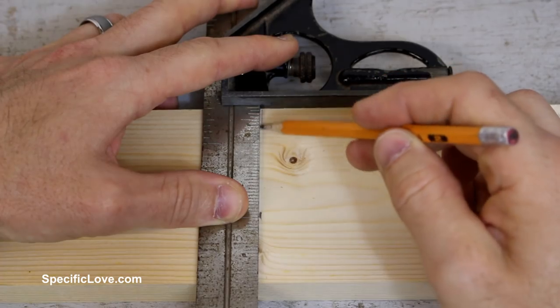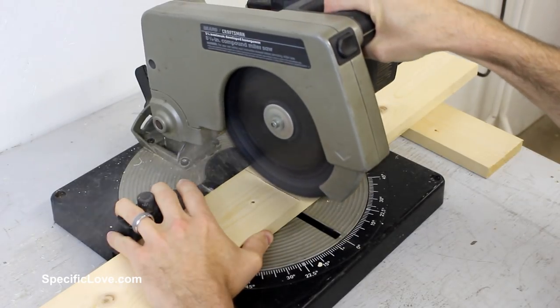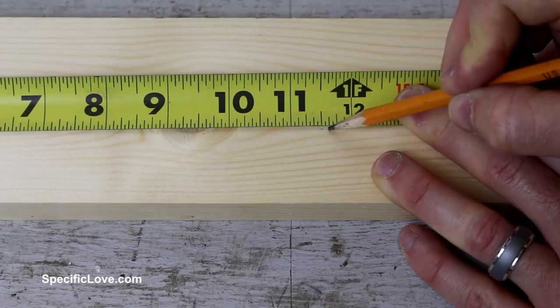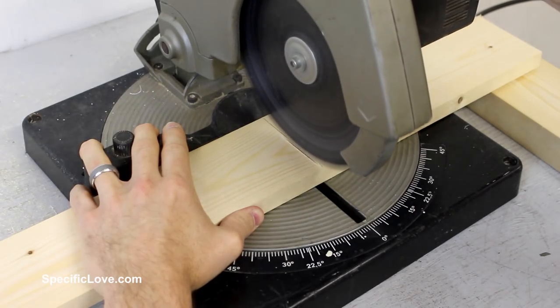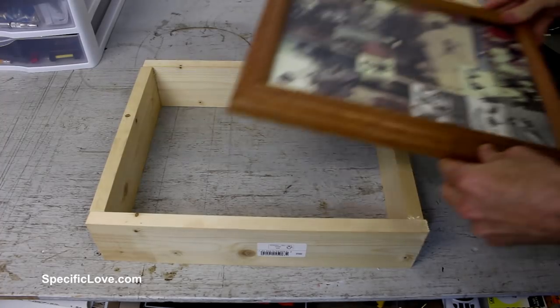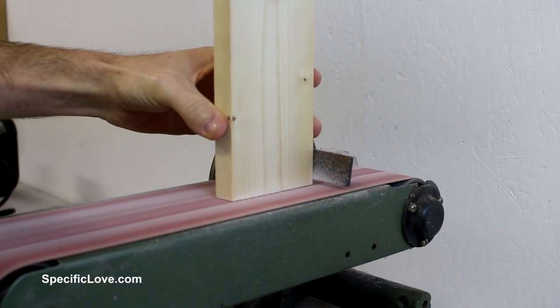To create the rear box, I picked up a 1x4x6 pine board. I chose pine because it's easy to work with and inexpensive. I measured and cut two pieces at 16 inches and two at 11 and 5 eighths. With a quick test fit, everything lined up perfectly with the frame. I then gently went over all of the edges with my belt sander to remove any burrs.